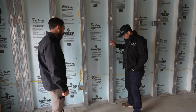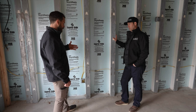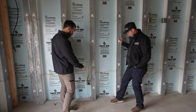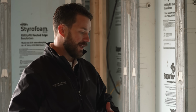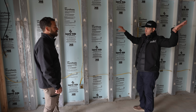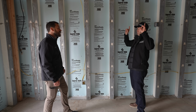And then after these walls are in place, I'm assuming this basement slab gets poured later. Absolutely. After the walls are set, the next step would be roughing in plumbing, and then you'd pour your slab. That locks the bottom of the walls in from coming inward. And is there a tie between the bottom of this foundation and the concrete slab? These ties fold down into the slab when you pour it, so it's connected at that connection. And then after your slab's in, you put your floor system on before you backfill. That's how you get your bracing. So the floor system's actually part of the bracing of this wall. Correct, to make sure nothing's coming in. So you've got concrete in the bottom and your floor system's tied in.